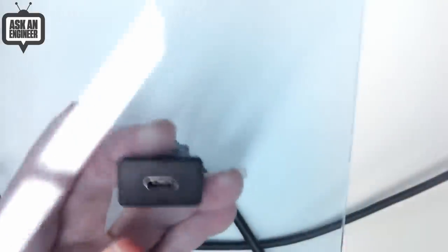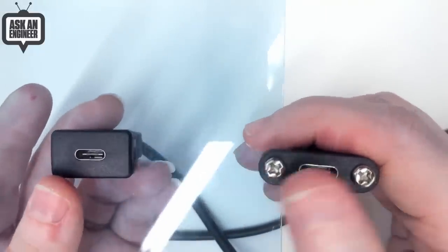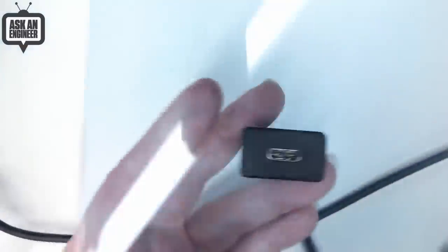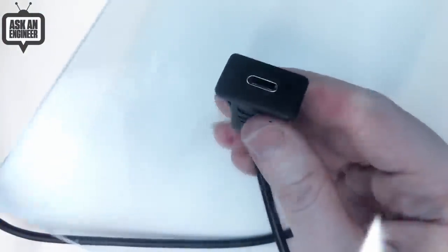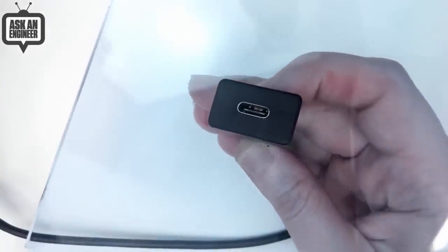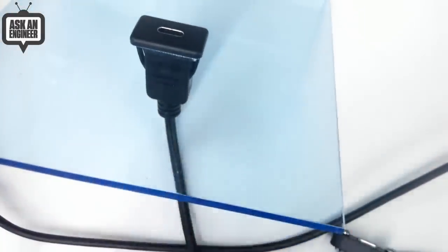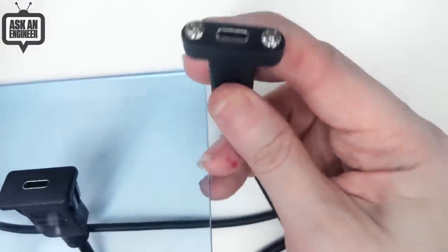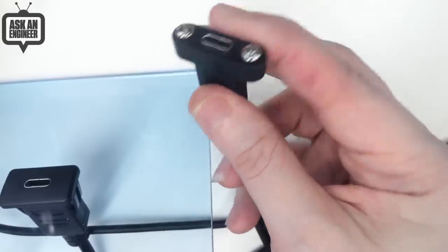The other kind we have you don't need as large of a slot — only a smaller hole, but you do need to drill. I actually really like this snap-in style. It's very slim, and you don't have to get two holes aligned perfectly — just cut a rectangular hole and snap it in. One limitation is it doesn't work on the thickest materials; the material has to be about five millimeters thick or less. Whereas with the screw-in type, it can be as thick as you want because you can always get longer screws.